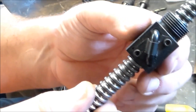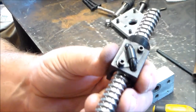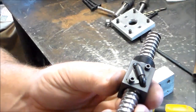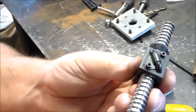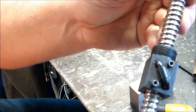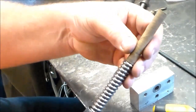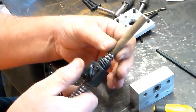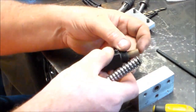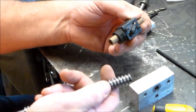Ball screws and ball nuts aren't going to be completely backlash free — I can already tell. I've heard guys talk about changing the ball bearings out to just a thousandth or something bigger to tighten it up a little more. It feels pretty good to me though. Oh — I just put it on backwards. I need these threads to the front. Now I hope I can get it back on this cardboard tube the same way. I don't want to be chasing the ball bearings all over the shop. Alright, let's turn it around the right way this time.